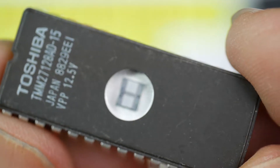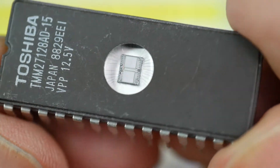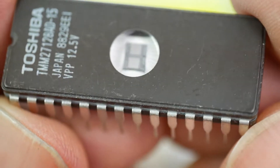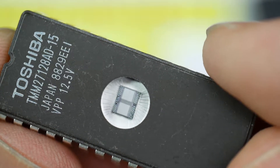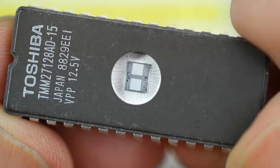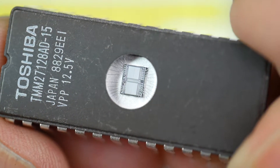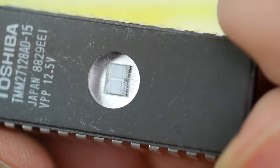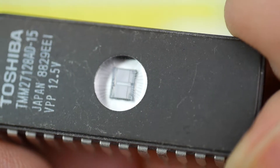Now that's by no means a large one. Here's another one — this one is a TM27128AD-15. That's the speed of it: 150 nanoseconds. In a 28-pin package — it needs more pins because it's got more address lines. Eight data lines, and you can see in the package there enough address lines for — in this case the 27128 is 16K — so this contains 16,384 bytes of memory, either data or program. You can see the bond wires in there, and the structure of the chip seems to be in two banks, with something down the middle and a rectangular memory array on each side.